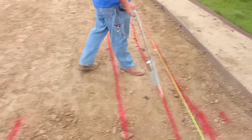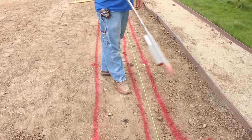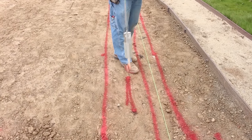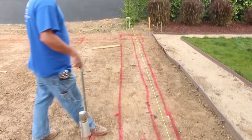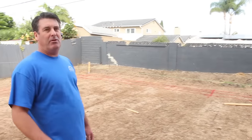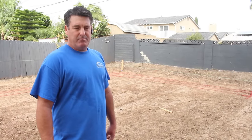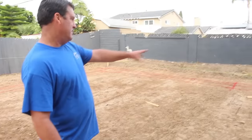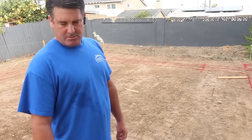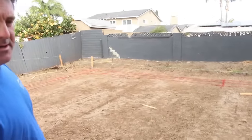This line is your building edge, this is your footing width — six inches — this is your stem wall, and then your slab. This is going to be set up for a monolithic pour — we're pouring the footing and slab all in one shot. It's getting four number fives all the way around, two top and bottom, with verticals that continue across the slab on 18-inch centers on number fours. Pretty beefy. We're going to get to it and start moving dirt.